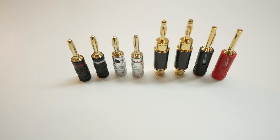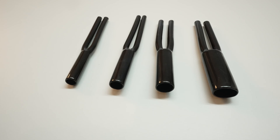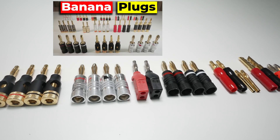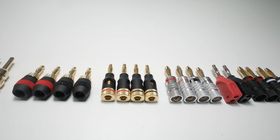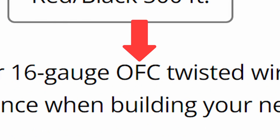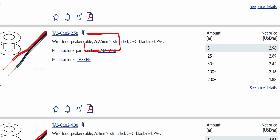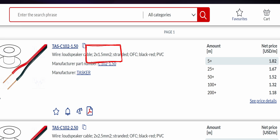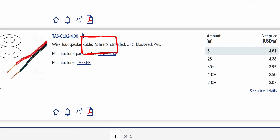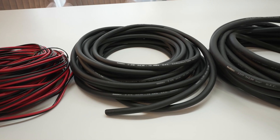We're going to need several parts to make this cable: banana plugs, copper wire, some sort of sleeve, and cable pants. We already talked about the banana plugs in a previous video and I'm going to choose a few types that I see fit for this project. For the wire, you're going to get some oxygen-free pure copper. 2.5mm is the one mostly used, 1.5mm is on the cheaper side but still good, and 4mm is a bit on the overkill range. We're going to use all three for this tutorial.